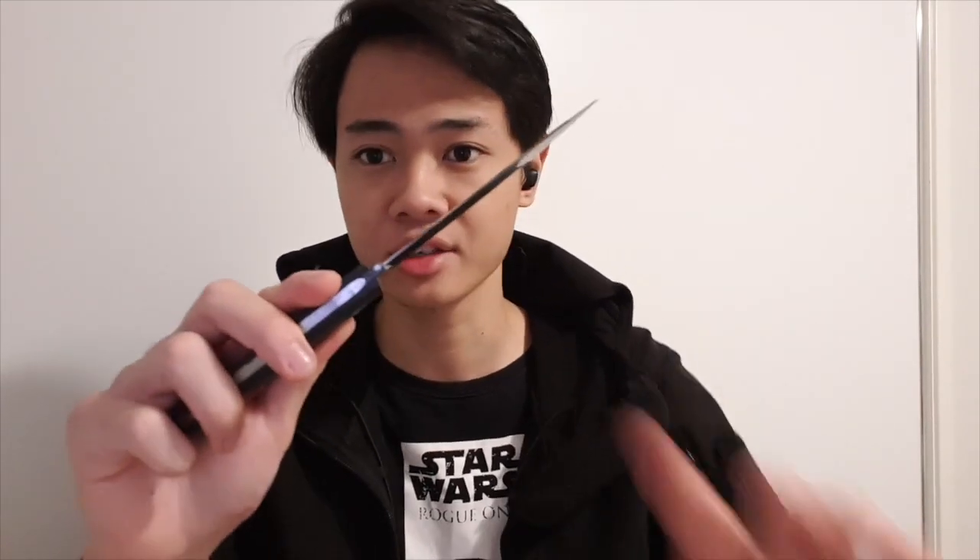I haven't been focusing on the Ringer lately — I've been focusing on the Tokyo Stinger. I want to take it and make it into a do-everything, jack-of-all-trades knife, like the SRK. The problem with the current version is that I ground the swedge on the back way too thin. It's still a false edge, but it's ground really thin — that ruins the strength because you've got less metal, which improves stabbing but it's supposed to be a jack-of-all-trades knife.